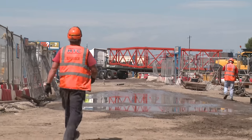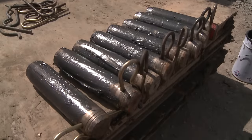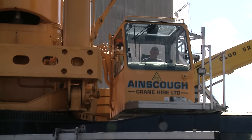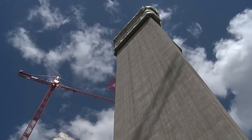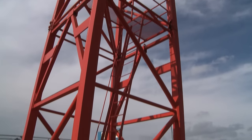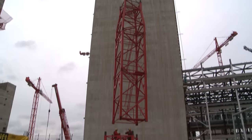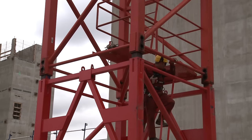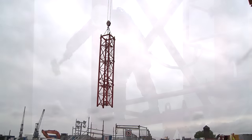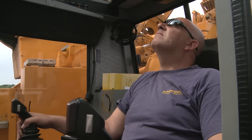The crane sections are delivered and inspected by the erection crew. Careful attention is paid to the pins and retaining clips. Mobile cranes, like all other types of crane, operate under strict guidelines — if the wind is too strong, work stops. As each section is lifted, the slinger banksmen and operatives on the mast guide it into place, locate the feet, hammer home the pins, and check and confirm that the securing devices are fixed and in place. The erection team, although they may have a head for heights, makes sure that harnesses and safety equipment are worn at all times.